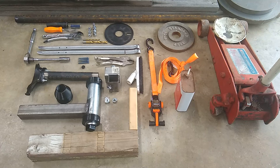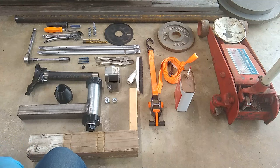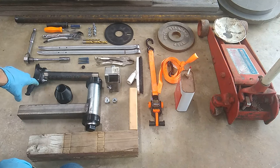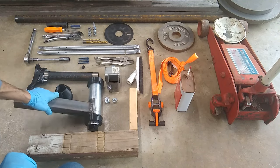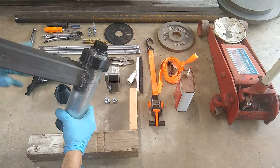Some of the other parts: if you've been looking at anything to do with manually changing tires, you've probably come across the Harbor Freight manual tire changer, and that's what I'm using. I've also added the Lucid Auto Works apparatus that goes on top, which adapts a duck bill that spins around the outside of the manual tire changer and allows you to unmount and mount tires. I was inspired by Lucid Auto Works's setup — I thought it was fantastic.